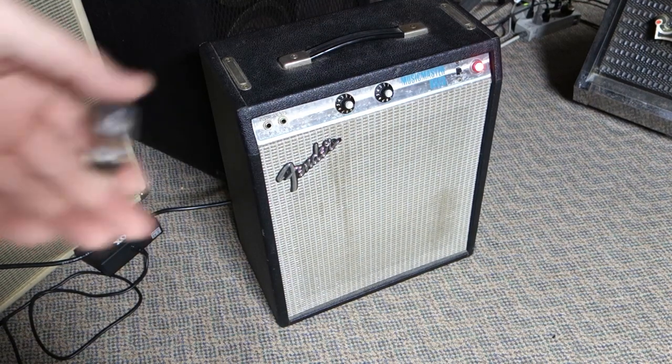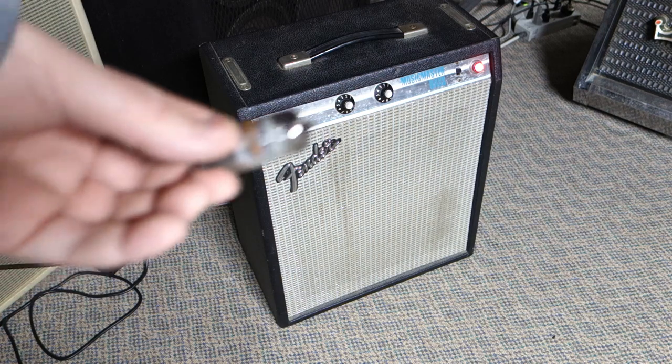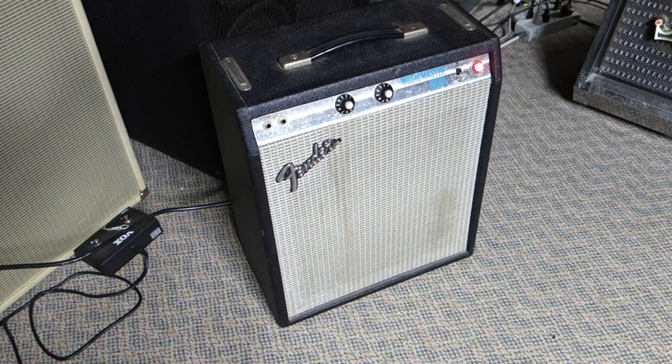I changed our vintage RCA out with a modern production tube, and the microphonics have gone away. Now I can tap on any of the tubes and we don't get much noise. The preamp tubes are always a little sensitive, but we're talking this is one tenth of the jingle-jangle. Probably being a bass amp and playing bass notes just eventually rattled its cage a little bit too much. If you still have a functional circuit, it's still a useful tube — just not for audio.